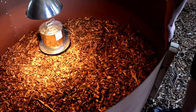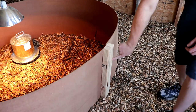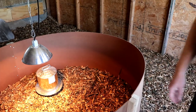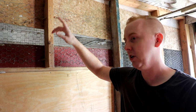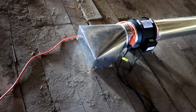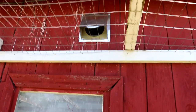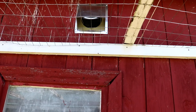The walls are a cardboard composite with the smooth side facing the inside. We've got two pieces of ripped two-by-fours held together with screws. As the chicks get bigger and we need to expand the space outward, we'll rip two-foot-tall plywood and elongate the circle to fill the stall. Up here is the exhaust system — an inline duct fan that pulls all the air out, creating negative pressure and exhausting it out the side of the barn. The intake runs on the floor of the second story and exhausts out the side, removing ammonia from the coop and helping reduce the smell.